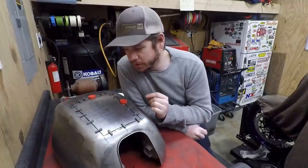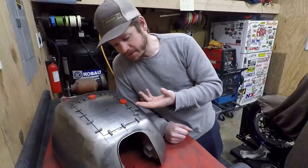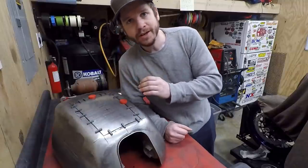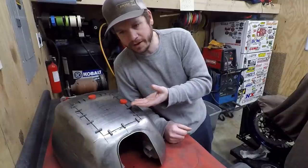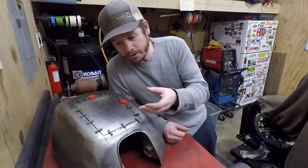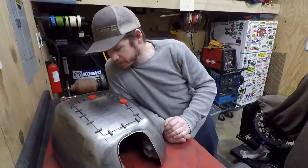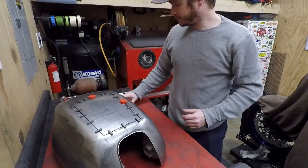I don't really want to, but in order for me to actually weld this, I would like to have at least a piece of non-ferrous, like a piece of aluminum, underneath as I tack in places, to help prevent burn through and have something like a heat sink. As well as the jigs, I have to make sure I can actually put the little tool in there. So what I need to do is actually cut the hole in the panel beforehand to fit the cap.